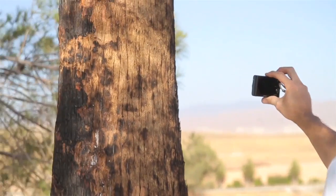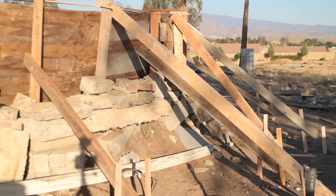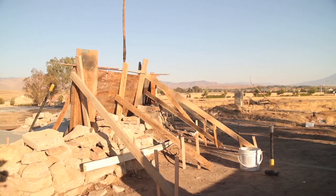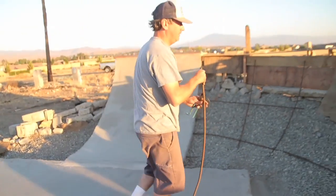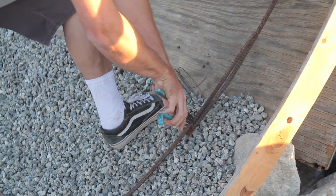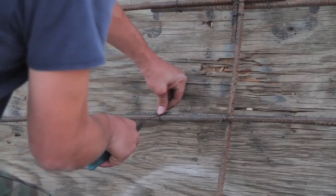We got Bakersfield Ben, who's done a lot of work on this spot — a lot of work on this particular obstacle getting it ready for us. He did it what he calls clubhouse style, just scabbing together all the scraps you can find around the lot. Kind of made a wooden frame, supported the back with two-by-fours and anything else he could find. Then he went in and tied the rebar properly. In this particular one, especially when using this kind of technique, you definitely want to use rebar because rebar is a lot stronger than chicken wire. And when you don't have all that backfill, you need that rebar — it's crucial.